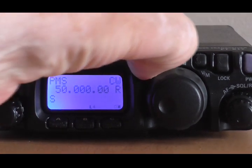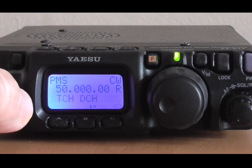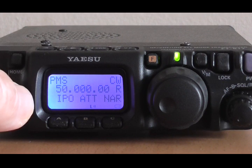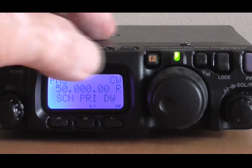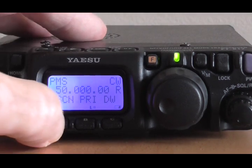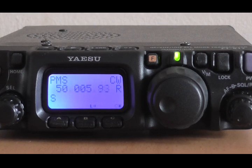And finally, we press the F key again and we find a menu called SCN scan — there she is. Press button A and that's it — it's scanning. And it will continue to scan forever and ever as long as power is applied. It'll take about a hundred seconds to get up to the full hundred kilohertz and then it will loop round again.